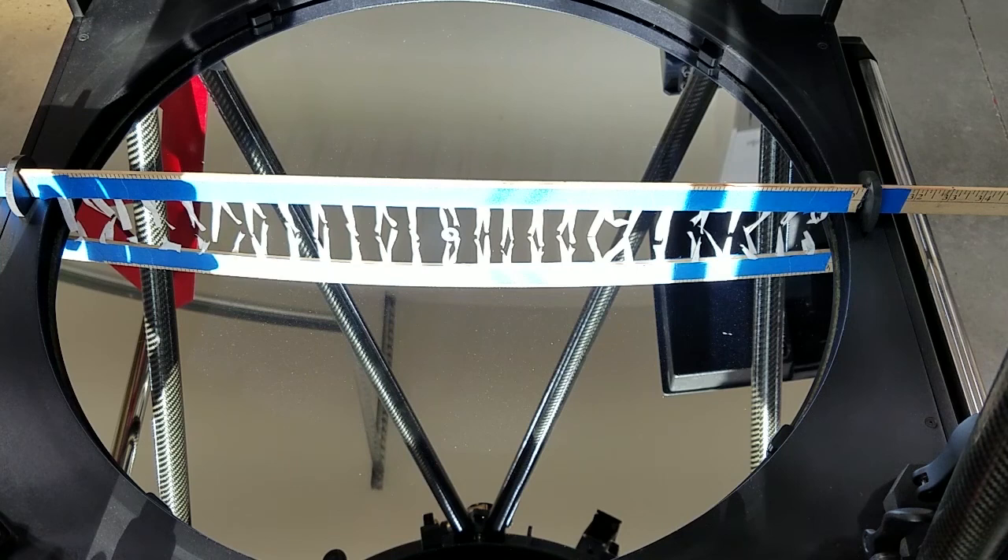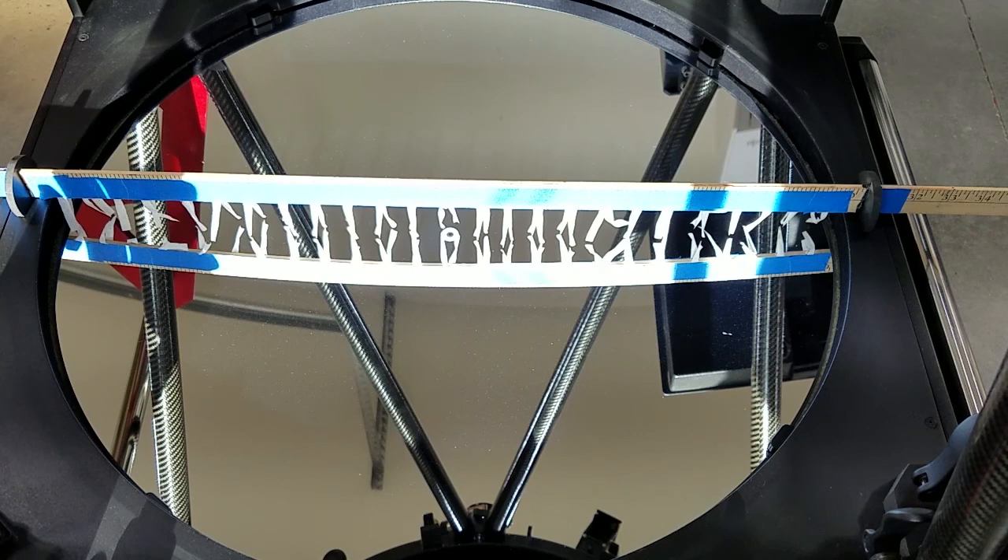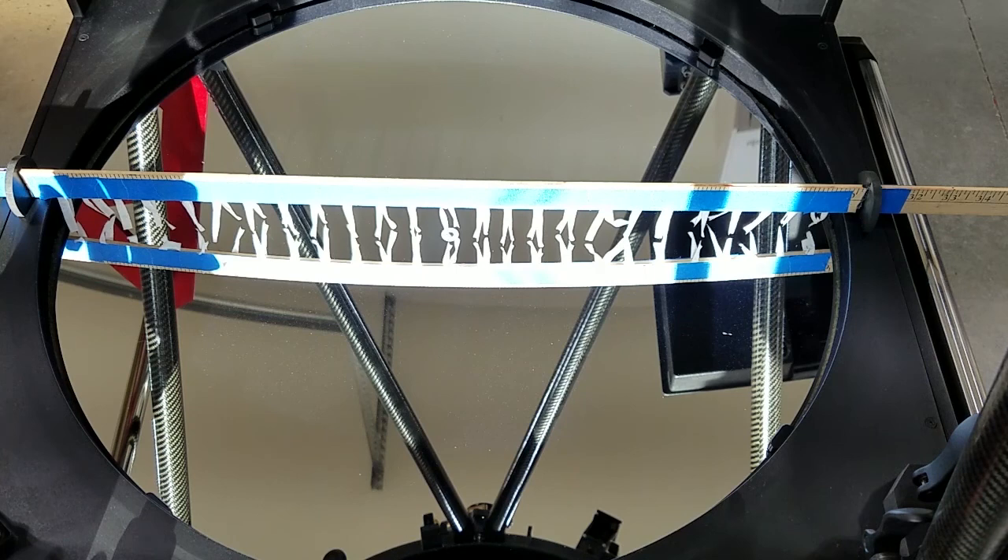Turbulence-based heat transfer from the boundary layer is by kinetic interface, which is different from a laminar flow's heat transfer, which is friction-based. If the entire mirror face were subjected to only one type of flow, the greater velocity at the edge would mean the edge cools much faster than the center. However, the transfer rates and velocity between flow types are inverted, and this has been used to advantage: where velocity is highest nearest the edge, the transfer rate from laminar flow is low, and in the center where velocity is lowest, the transfer rate from turbulence is high. So despite the velocity difference, a remarkably even heat transfer rate occurs — without building anything over the mirror.